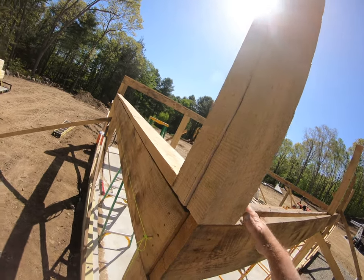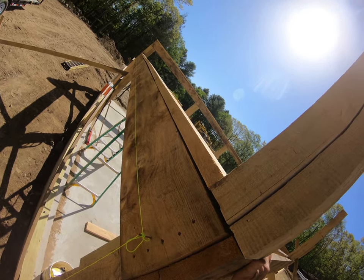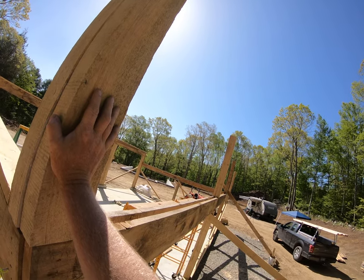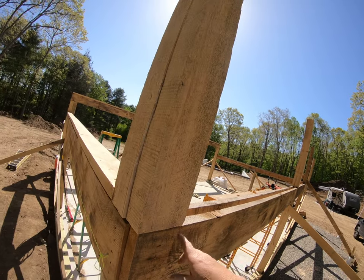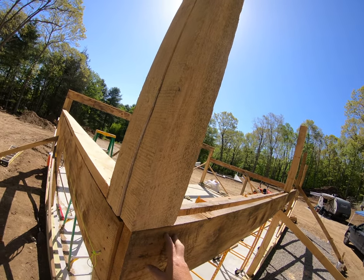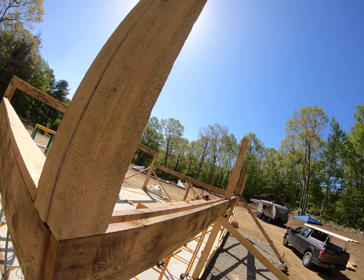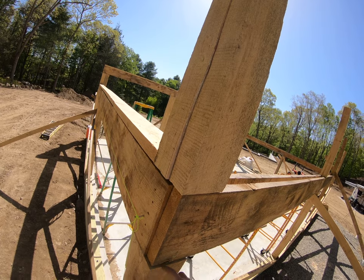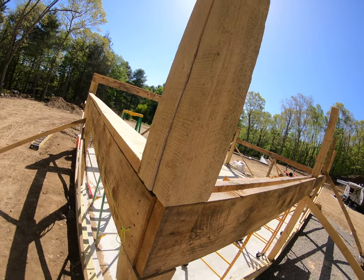I think you said you can't have a hinge in the wall, so we had to do it this way. We got these 12-foot posts. You saw my brother and I cut the notches in them. And when we were cutting them, especially the corners, you're taking 3/4 of this 6x6 away.